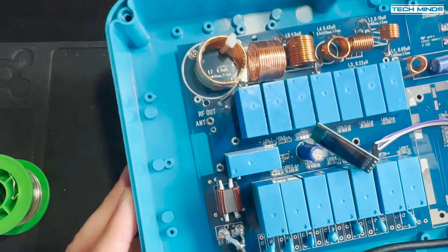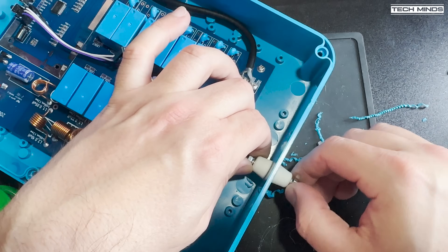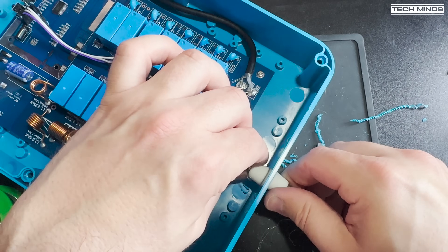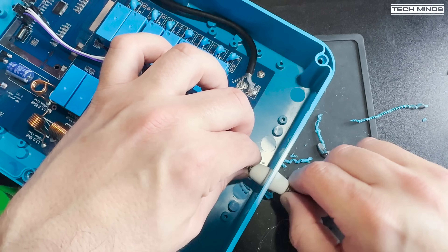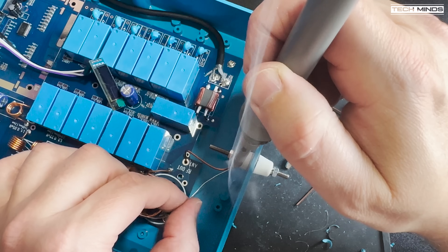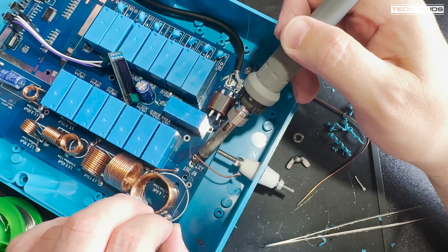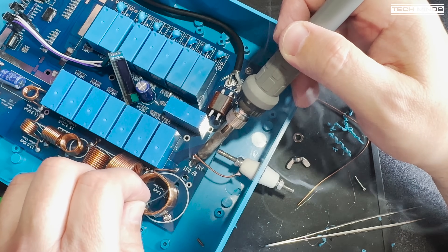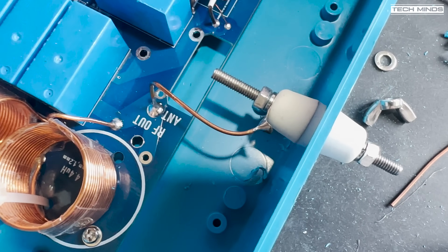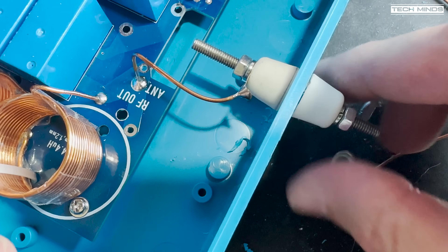Next I installed the output connector, which is an insulated wire terminal. These have a porcelain feel and they crunch when tightening the nuts, so don't over-tighten them or they will break. To connect the terminal to the board you can use the supplied copper wire — it's quite hard to bend, so I suggest bending and measuring how much you need before soldering. You will need a fairly hot soldering iron to get the solder to adhere. Note that in my kit there were two lengths of copper wire — one enameled and one not — so you will need to scrape the enamel off for the solder to adhere.